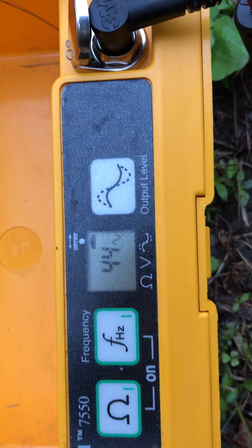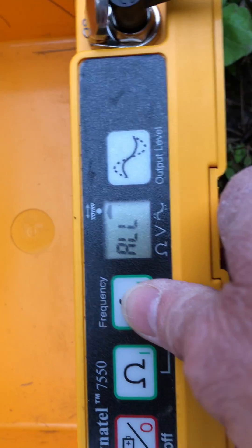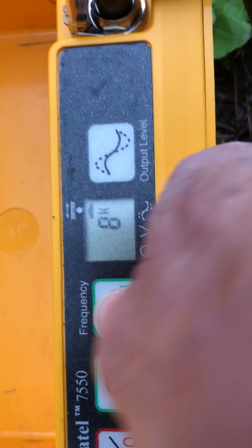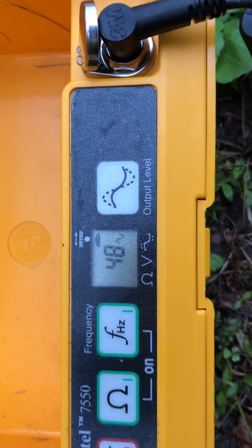82k is 44, and 200k we're back to 25. Reviewing all frequencies: 577 gave 33, 1k was 37, 8k was 45, 33k was 48. I'm going to trace this on 33k because I got the highest signal strength.